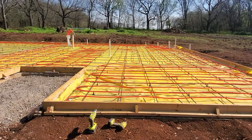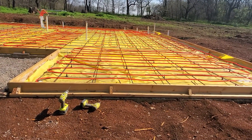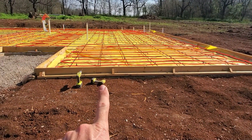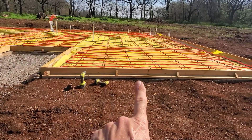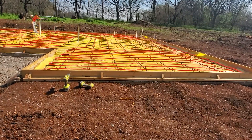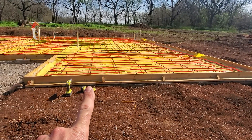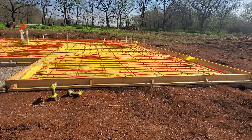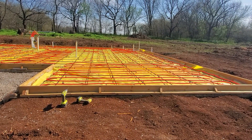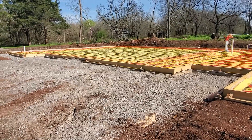I was sitting back in the hammock relaxing while the new manifold was repressurizing the system, just looking across the top of the forms, and this form just didn't line up quite right. Looking back you can see there's a bow right here — I've got an anchor bolt there and an anchor bolt there, and right here the wood bowed. Luckily I was just sitting and waiting and happened to notice that. I'm going to drill a new hole right here, Tapcon that down, and re-level it. If I hadn't caught that, when they ran the screed across it there would have been a hump. Looked everywhere else and everything else looks okay — just this one spot.